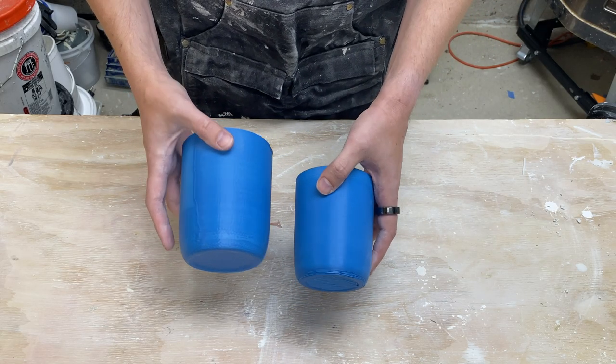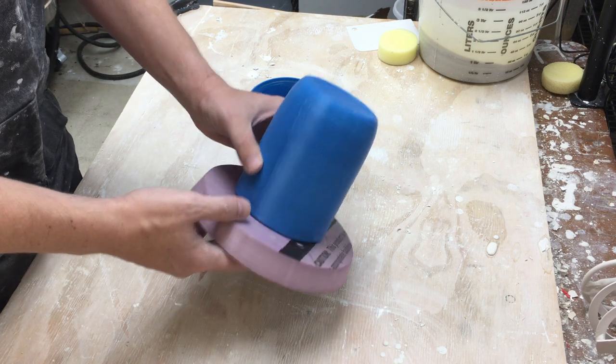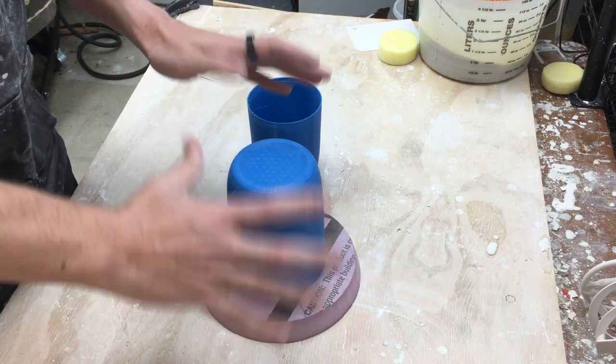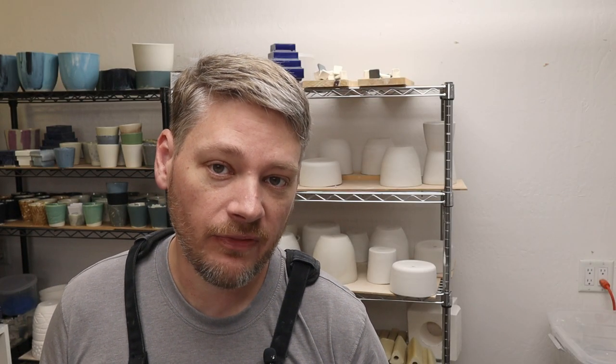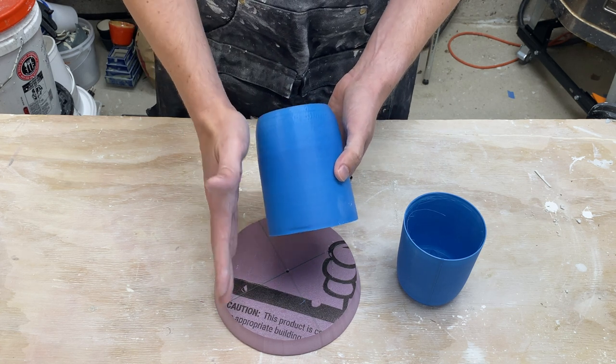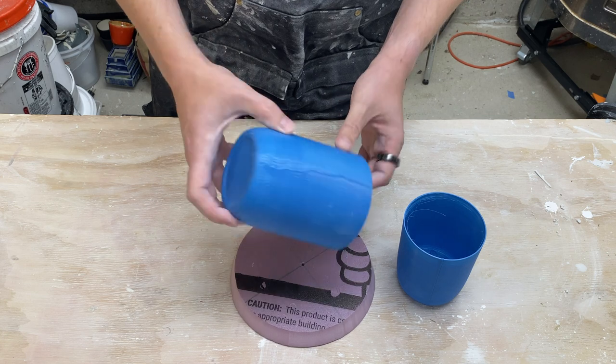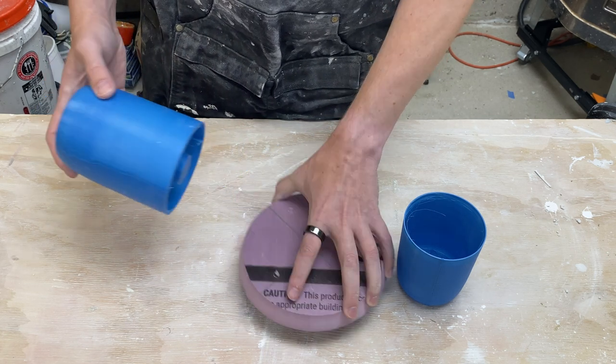At this point, we can do exactly what we've been doing in the past several videos — cut out something to make a slip well, attach it together, put it down, build the cardboard structure around it, and make our mold. We can then slip cast the pot, and when it finally shrinks and we fire it, we should wind up with a cup that is very similar to the target size. So if you have access to a 3D printer but don't know how to do modeling, that's actually a great way to go and make new forms. By using 3D printing, we vastly open up our options. We still need to take into account draft angles — this one here is a one-piece mold with a draft angle all the way down. However, I really don't like modifying our forms. Since we're 3D printing this, why don't we go ahead and print the slip well as part of it as well? And that's what I have here.